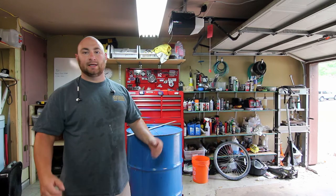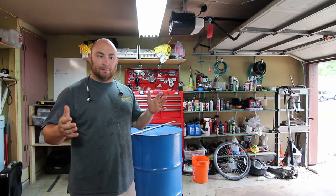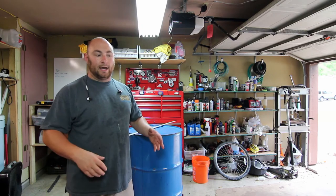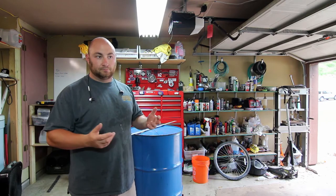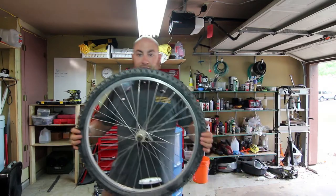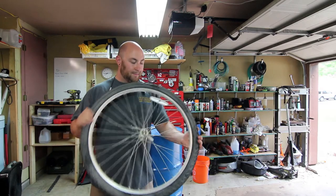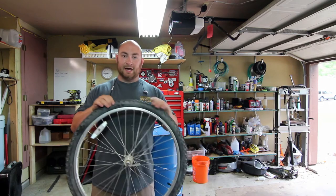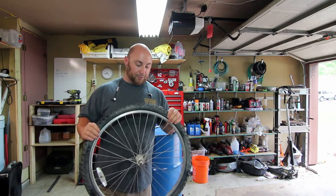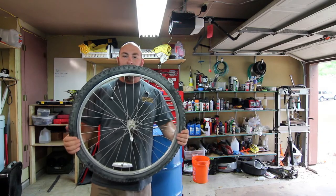I have a lot of friends, especially down in South Austin, who ride bicycles. One of the coolest things I want to build is basically a six-bicycle rack that will get mounted into the ground to hold bicycles. I borrowed this bicycle front wheel from a buddy — it's off a mountain bike type bicycle and the tire is about two inches wide. So we're going to make our slits about three inches wide, or about two and three-quarters, so this wheel will sit inside the half-barrel cut and won't move side to side, and your bicycle won't fall over.